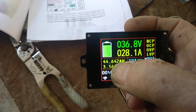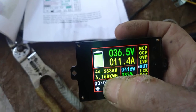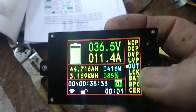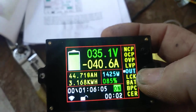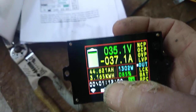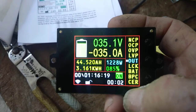These numbers here — that one's going up. I figured this was a 50 amp hour battery. This right here shows the kilowatts too, and that should be going up as well — that's the kilowatts put into the battery. When I go to the discharge mode, now it's showing discharge. This right here is the time it thinks you have, so it thinks I've got about an hour and 12 minutes to take out those 45 amp hours. You can see the amp hours clicking down as we're talking.